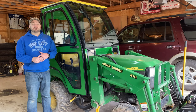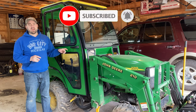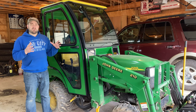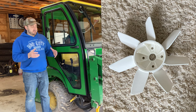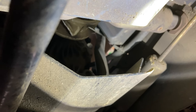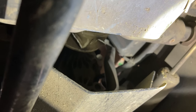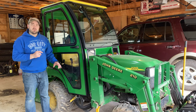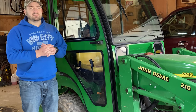When I did some research on Tractor By Net and a couple of John Deere forums, I found this is actually a fairly common problem with the 2210 and the 2305 — and not only John Deere tractors. Some of the Kubotas, the BX23, and other small compact tractors of multiple brands use a fan to cool the hydraulic transmission. You can't completely enclose it — there has to be an opening or at least mesh — and it's pretty common for people to shear or break the blades off the fan, and the repair is never easy.